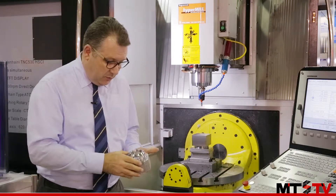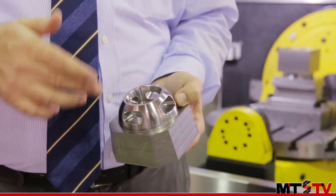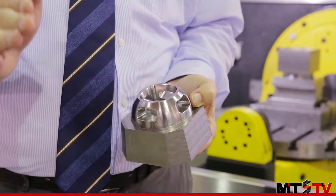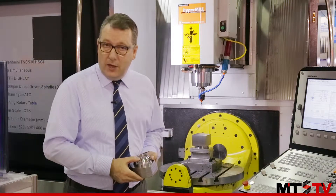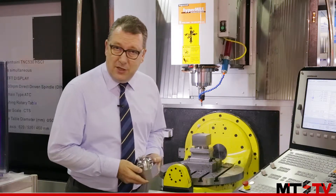Finally, let's have a look at this workpiece. This workpiece was produced entirely using an end mill rather than traditionally using a ball nose, and this was produced in only 10 minutes, whereas it would have taken over 30 minutes to produce this using a ball nose tool.